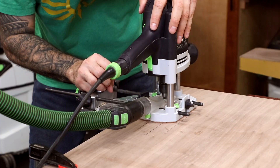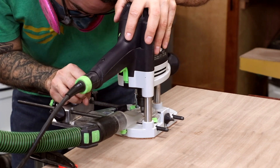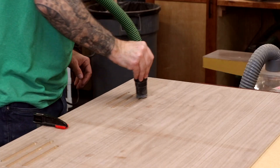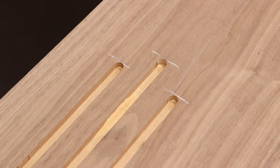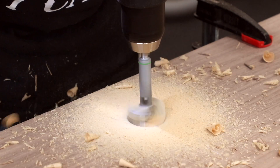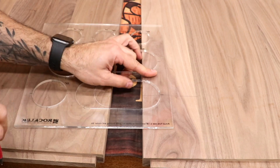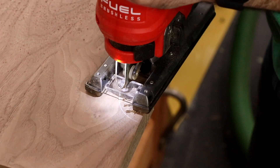To allow for some ventilation, I cut a few slots in the back panel near the top using a three-eighths-inch router bit and an edge guide. You can have fun with this — make a design that looks interesting. As I mentioned at the beginning, if you have heat-producing gear in an enclosed space you might need to consider more substantial ventilation. At the bottom of each compartment we use a Forstner bit to drill a large hole big enough for plugs to pass through. On the partitions we cut a semi-circle that allows cords and wires to pass between each internal compartment.